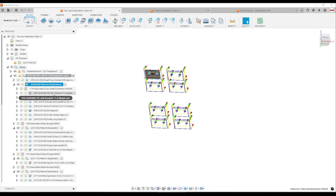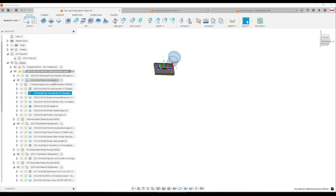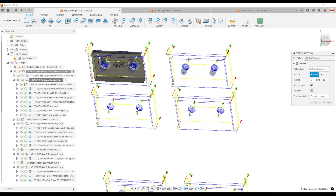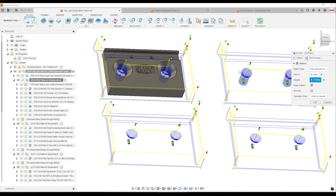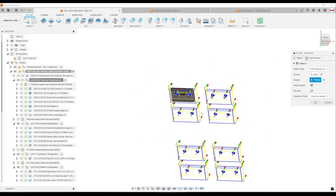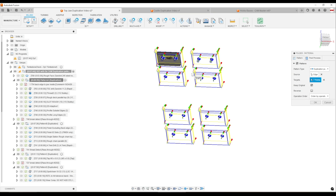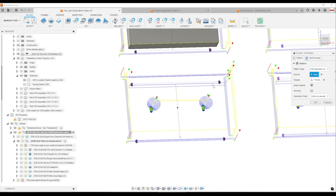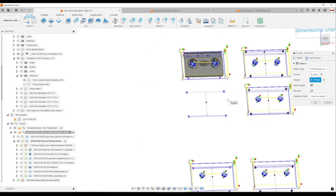Then we hop into the pattern and it's going to start doing all the work. That pattern is driven by the source point — a single point — and then the targets are the other seven points. The other wonderful thing about this: if for whatever reason something happens in part number three — it's a bad piece of material or has a broken piece of carbide — and you want to run the rest but not that instance, all you have to do is turn on that sketch, hold the control key, and select the one you want to skip for the current run.